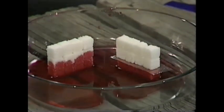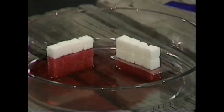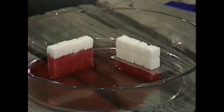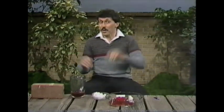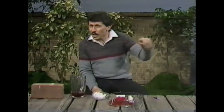Within seconds you can see what's happening. The wall on the left has no damp course, so the water rises up all the way — before long it'll be to the top of that wall. But on this side, because of the damp course, the water can't go past the first layer of bricks, so the rest of the wall is safe. What I'd like you to do is look at all the brick houses you can find nearby and see if you can find damp courses. You'll often be able to find them because they use a darker coloured mortar — see how many you can spot.